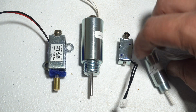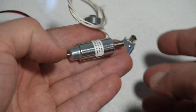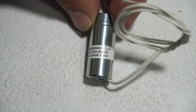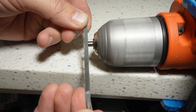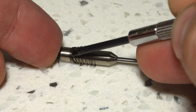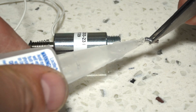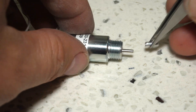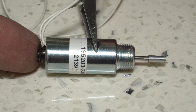I was playing around with some solenoids and I really like these round ones from Ledex, but annoyingly the little plunger part just falls out. Fortunately that was easy enough to fix with a drill, a file, a C-clip, a spring, a piece of aluminum tube, and some super glue. Okay it wasn't that easy to fix, but now these work very well.